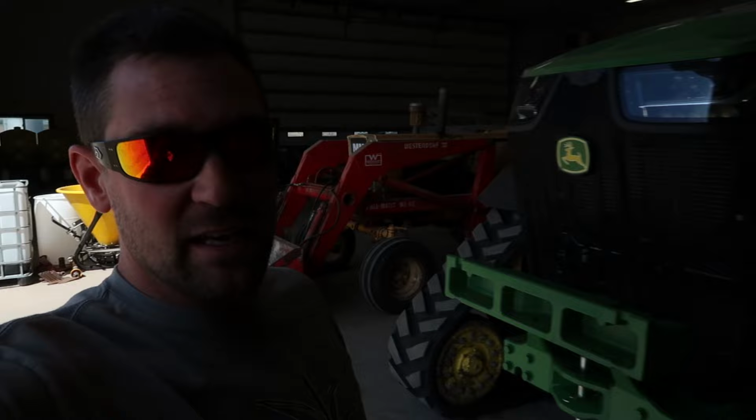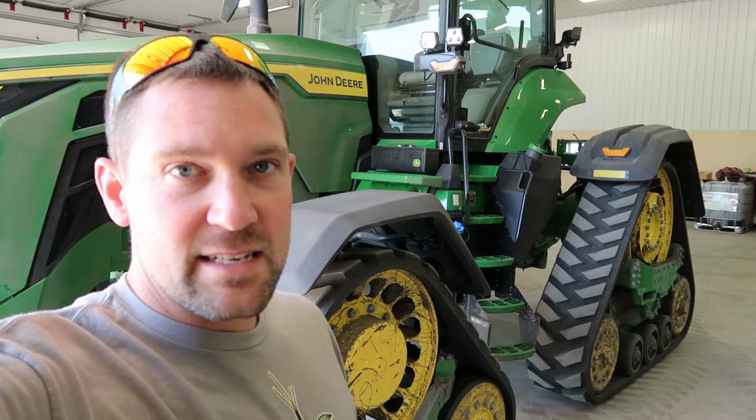Family meeting is over. I gotta go as fast as I can and explain to you guys what I think about this tractor. First off, some of you are really interested in the ExactEmerge planter. I did a lot of talking about that in my videos. You could see what kind of a job it was doing. Oddly enough, it singulates better at 9 to 10 miles an hour than it does at 5 to 7 miles an hour. It is a high speed planter and it ran well.